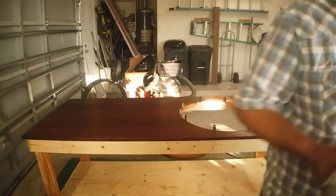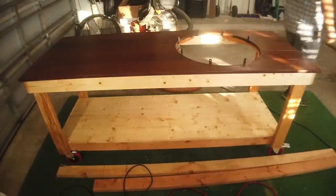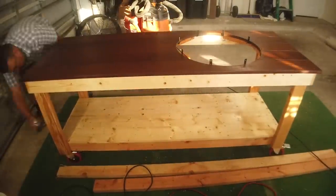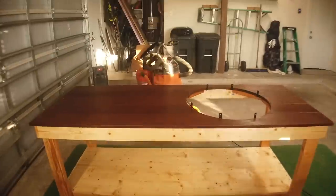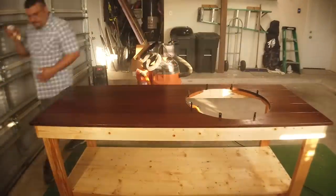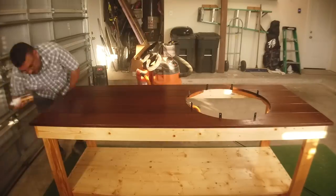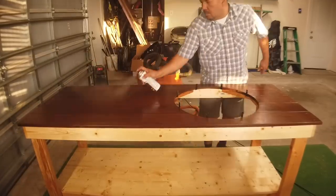And then once that's done, I stopped for the night to make sure everything is dry for tomorrow morning. The 4 coats, now I don't know if you noticed, but I sprayed in all 4 directions. So I started off on one side, sprayed it, went to the other side, sprayed it, and went in 4 directions to make sure that there was even coverage.